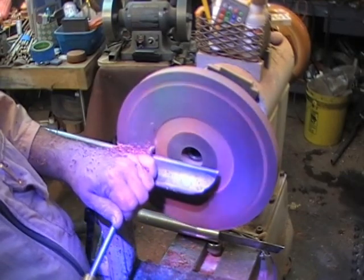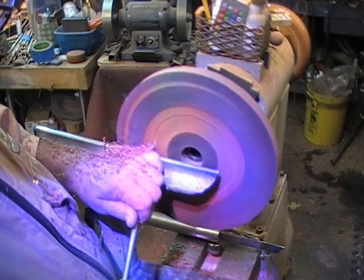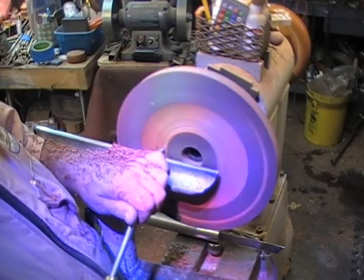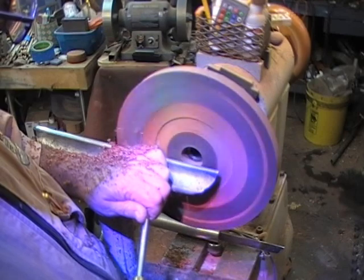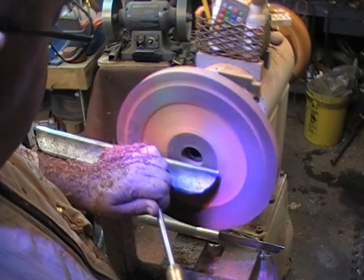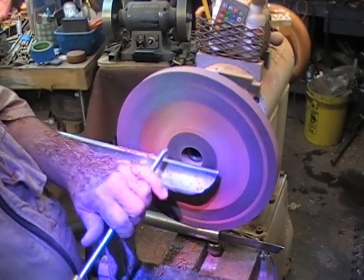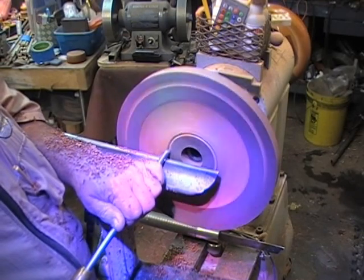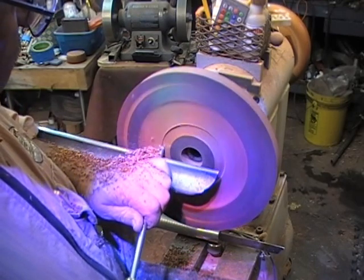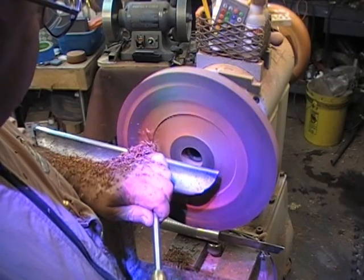See the swing of the handle? Why? Because I want a graceful curve. I can't get a graceful curve pulling on it. What you're seeing here is I am compressing fibers as I was going in. But as soon as I got in and got to the bottom and started coming up, I started pulling on fibers. So what I did was yank it off the chuck.